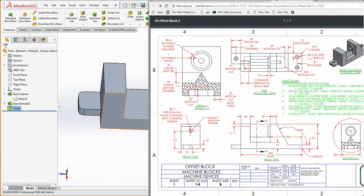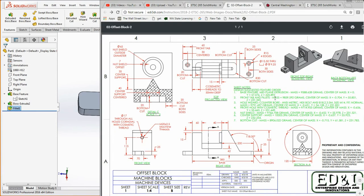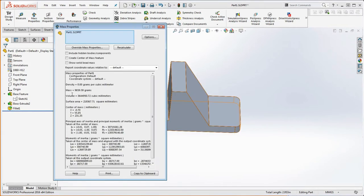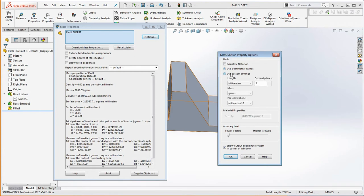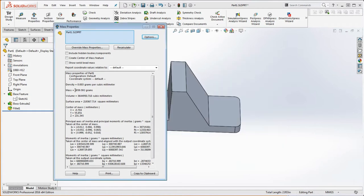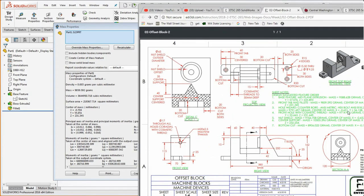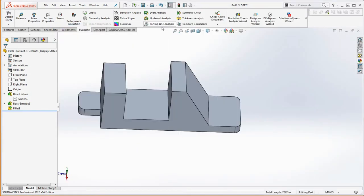Let's go ahead and back to our drawing to check mass properties. After front tab and fillets, that should be 98,592. Let's go to options and increase to the highest resolution. It's 98,592 — center of mass X is negative 704, Y is 851, and Z is 231,345. I feel pretty confident about that and you should too by the time we get here.